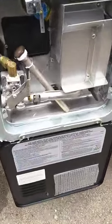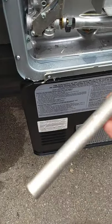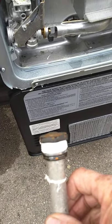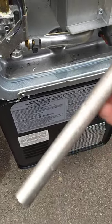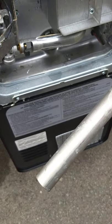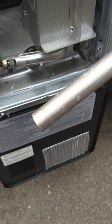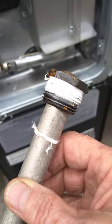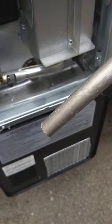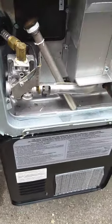The plug is out right now and it's empty. The thing attached to the back of the plug is an anode rod. It's a sacrificial rod — if you've got minerals in the water, they'll attack this rod instead of the lining of your water heater. This will get eaten away over time, so roughly every three years you need to replace it, depending on what type of water you're using.